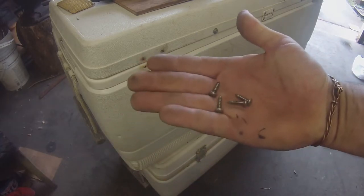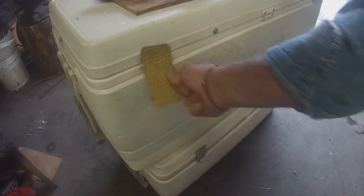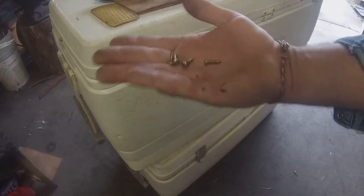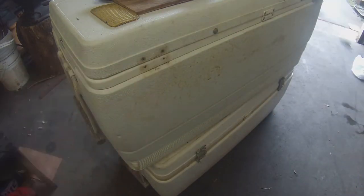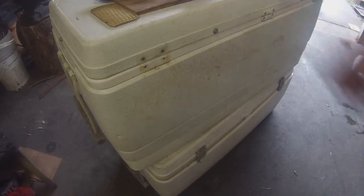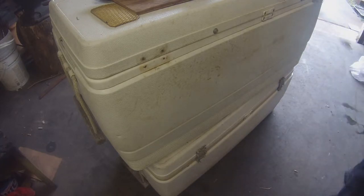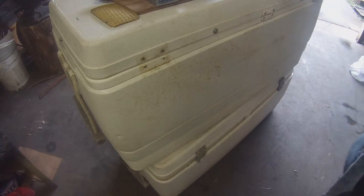As far as the hardware — the screws — you could go back with just four. You don't actually have to make them as big as this; you could literally cut them in half. But I'm a big fan of overkill, and these coolers get used a lot. So the hardware you pull off the old hinges is sufficient to do the job, but I went overkill. I went to the local hardware store and purchased a box of them. It's number eight by five-eighths, stainless steel. I would not do anything but stainless because it's a wet environment and they're going to rust if you don't.